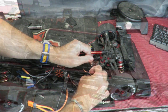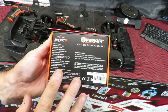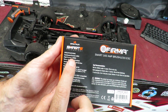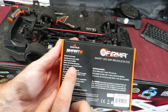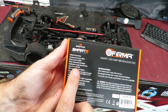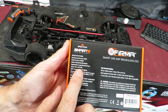I would leave that screw in if you're doing this job so you know exactly where it's going back in. Now we've carefully got to find out which port the ESC is going into. Okay, now it's the new 160 amp ESC. Get prepared for one of the biggest 'whoa moments' - continuous current 160 amps, peak current 1050 amps. Sensorless brushless motor, large scale surface.